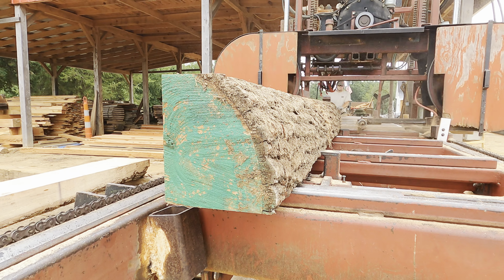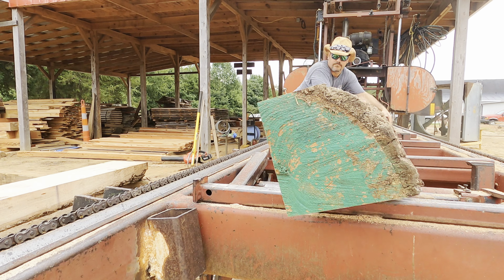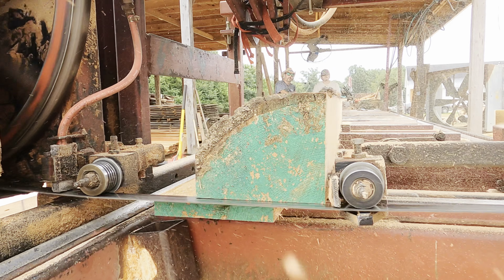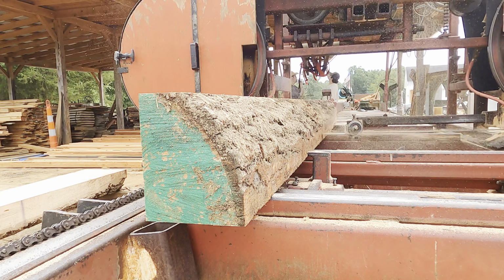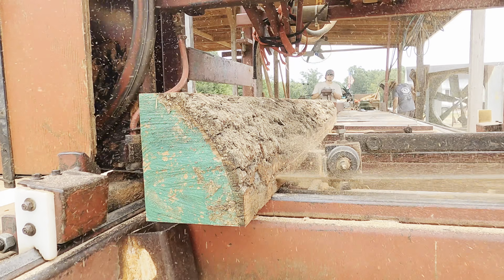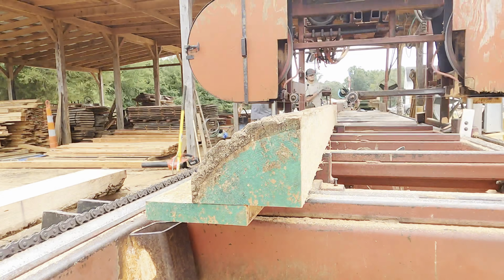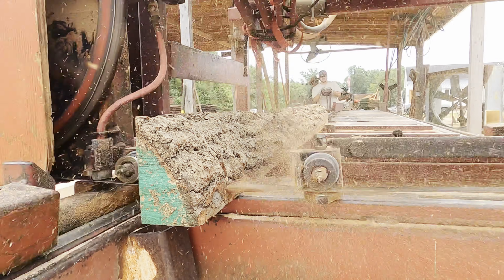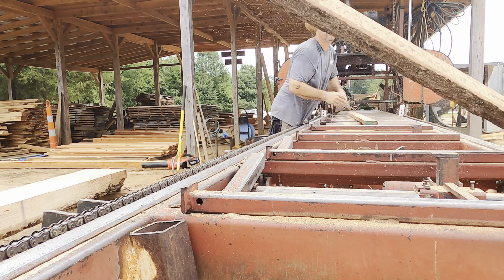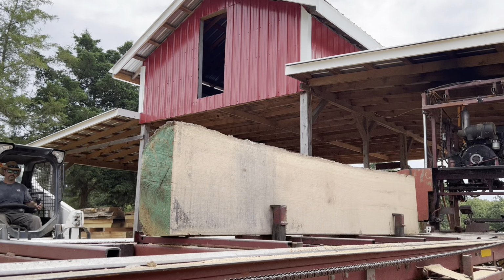What we're sawing this is quarter sawing. We're sawing it in 4/4. Customer wants a 3/4 inch board when he is done planing and working this stuff up. So at 4/4, that's on the hardwood scale. It's usually on our scale, when we cut 4/4, it comes out about 1 1/8 inches. So that allows, we think, for enough shrinkage, and he'll be able to plane that down and get his 3/4 inch board. So just gonna let you know what scale we're cutting it on, and we have different widths here. All this stuff is 8 foot. So I hope this helps y'all.